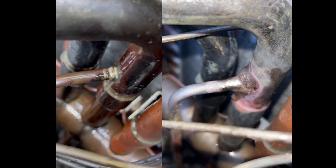When you're doing this, you want to move your wand around all over all joints, capillary tubes, and the coil. After I got done with it, I had to remove the refrigerant, globbed a bunch of solder on it, then pulled a vacuum and recharged the unit — so you can see the difference there.